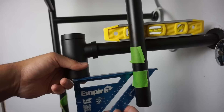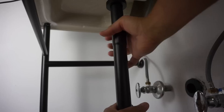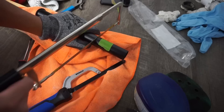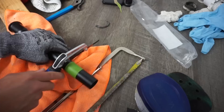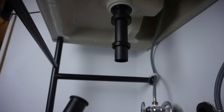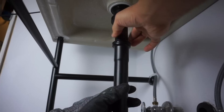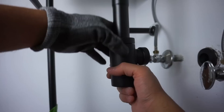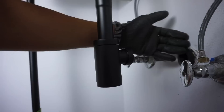Once that's done, remove the existing masking tape except for the first cut line. Take off the piping. I'm using a 2x4 for leverage, covered with a microfiber towel so it doesn't scratch the matte black finish on the piping. Using a hacksaw — I like to finish with a handheld hacksaw — then deburring the edges with 120-grit sandpaper. Fit it once again: insert the nut, tighten as you go, unscrew the top nut, insert the barrel, and tighten. Now it's properly aligned with the drain hole.